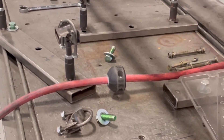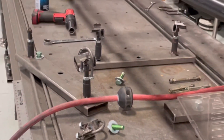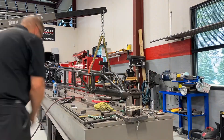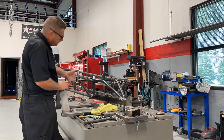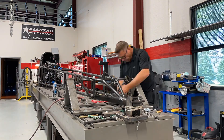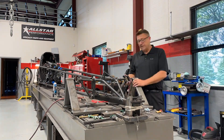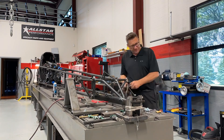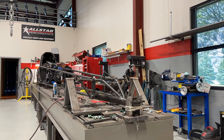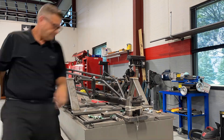These other pieces I've made are basically like a shock extension adjustment piece — it's also a muffler clamp and a chunk of chromoly tubing cut in half. That's how I hold down and am able to adjust that front end piece however I want. We're going to adjust this whole thing with a straight string that goes all the way down from one end of the jig to the other. We'll measure each side of the cage, each side of the lower rails, and have this thing perfectly positioned with a center line.